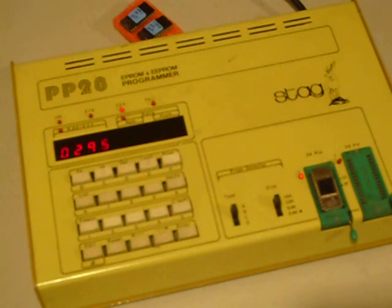When you're working on this kind of equipment, if it has through-plated holes on the circuit board, a lot of times you can get the equipment working just by repairing them, because they had trouble with those holes back in the 80s. Heathkit had a lot of trouble with through-plated holes. I bought a nice Heathkit frequency counter at a ham fest very cheap, and a Heathkit engineer I knew told me to fix the through-plated holes and I'd probably have a good counter. I fixed them and it's been on my workbench for probably 25 years working just fine.